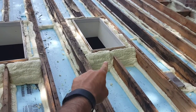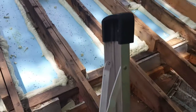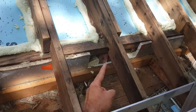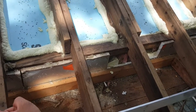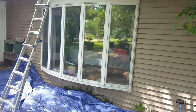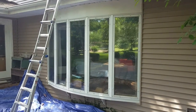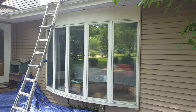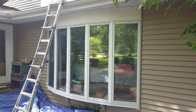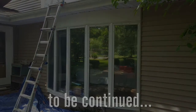That rafter was cut for a skylight and is unsupported at the end right there. On top of that, there's a bow window in this area — someone retrofitted this bow window without putting a header in. This is a nine-foot wide window with no header. You can see how that was done — no header. It's unfathomable that someone could be that careless and reckless. They are either bad builders, bad remodelers, or a dishonest person who took advantage of an unknowing homeowner. In any case, it is very sad — we need to fix that while we're here too.